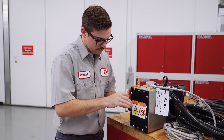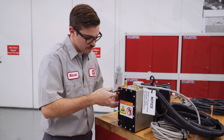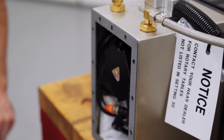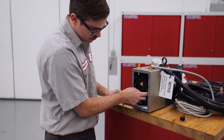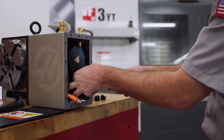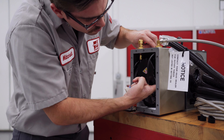If the J-box is attached to the enclosure, locate the cover plate adjacent to the J-box, unscrew the bolts, and carefully remove it. Next, locate the J-box wires inside the enclosure, remove and set aside any cable wraps, and disconnect the cable connectors. This may take some finagling, so be patient and ensure that the cables are properly disconnected and none of the enclosure wiring gets damaged.